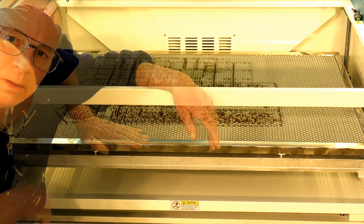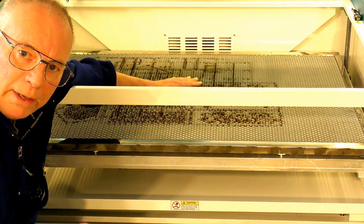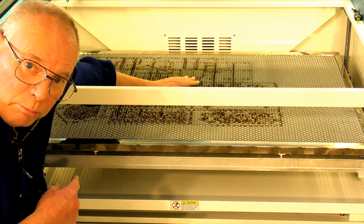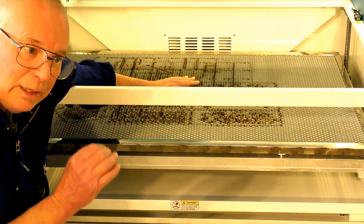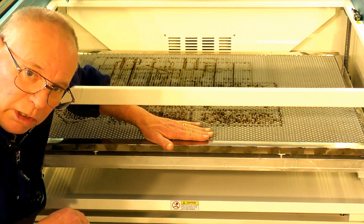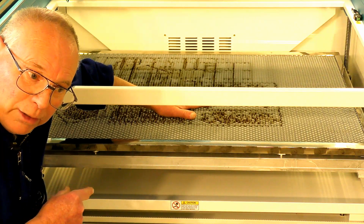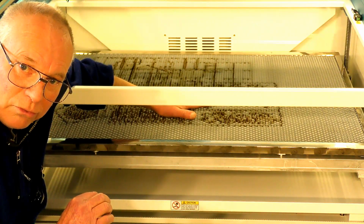Like that. So this means that you can accurately locate a part on your honeycomb bed or even locate a jig on the honeycomb bed, and you know that it's going to be in exactly the same spot every time, because the honeycomb bed is locked in position. So you can actually attach something to the honeycomb bed every time and know it's in exactly the same place.